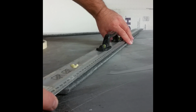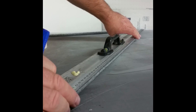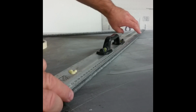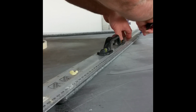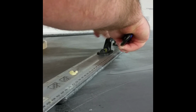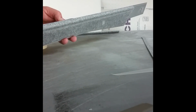This is what I usually do with the wood Elevons to make the edges of them true, because a lot of times the wood, again too, doesn't come from the factory. So you could use this same type of process on the wood Elevons if you want to really make the trailing edges nice and true. So lay your straight edge on there. Hold your angle. Got a little bit of a bevel on it. And try to do it like one nice linear stroke. And what you did is you trimmed off the area that was a little less true than you desired.